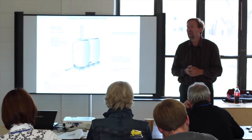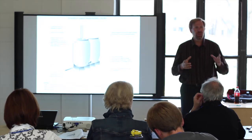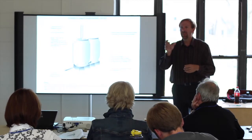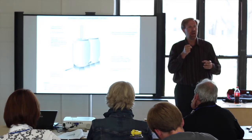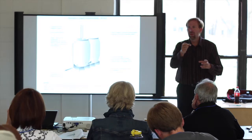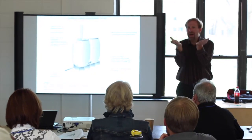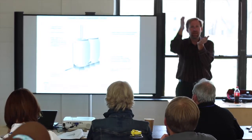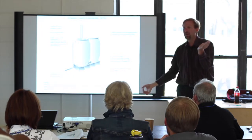Barrel distributor. They have the wine barrels from Napa Valley, but they also have conversion kits for the downspout. They give you a drill bit, you drill into your downspout with a corded or cordless drill. Then you squeeze this plastic rubber flange and put it in, and it pops open inside. When it pops open inside, it collects the water and runs it down a tube, and that tube comes out into your barrel.